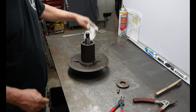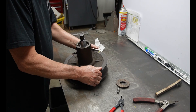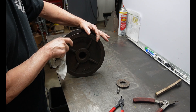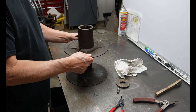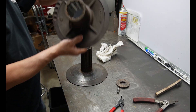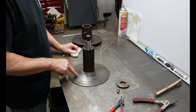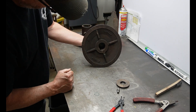A little over an inch of travel probably. Before I take it apart, I want to show you there's a little arrow cast right here, and there's a little notch right here — kind of got some yellow paint marker in there. These were balanced as an assembly so you line those up when you put it together. In actuality you could put it anywhere, it fits together any which way. But if you want it to be balanced, that's what all those little holes are there for. This part is balanced and it compensates for both of them — so a single plane balance.